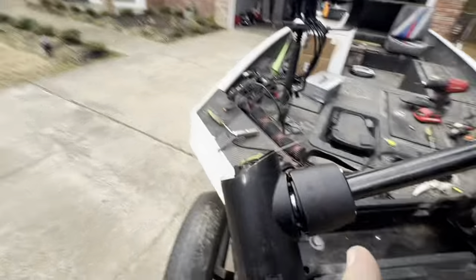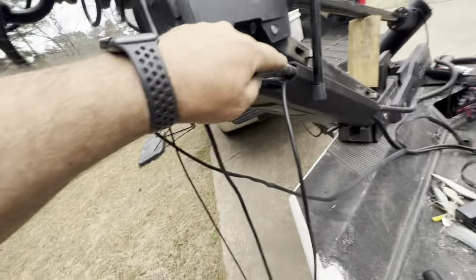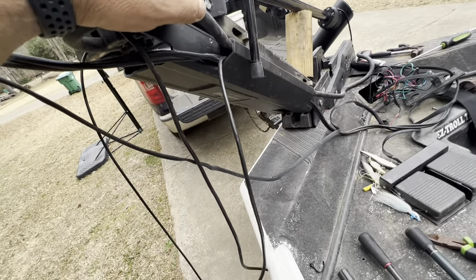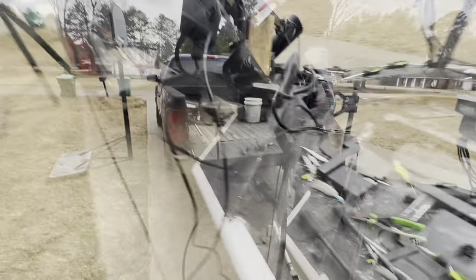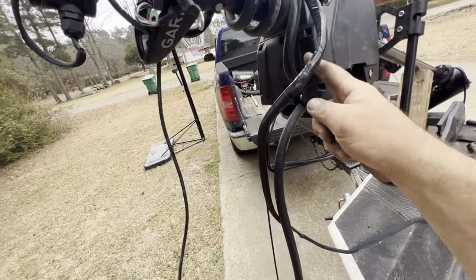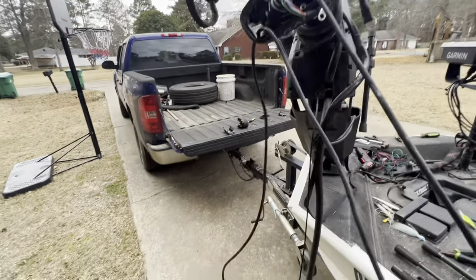You're going to need to pull your transducer cable through, but also pull your power cable at the same time. It is so tight that if you don't thread them together, you'll never get it back through there. Go ahead and remove your cap - there's a new cap provided in the box with the new transducer. Make sure when you thread it back that you follow these four wraps and reassemble it with the clips properly. You've got a $3,000-$3,500 trolling motor - do it right.